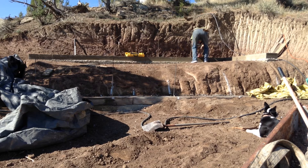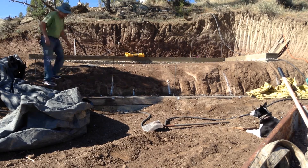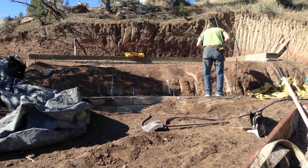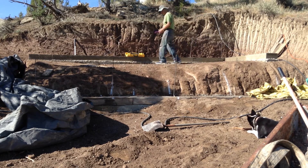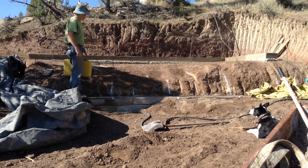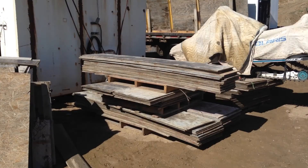The doggone stick supervisor is back, patiently waiting for me to throw a stick for him. In order for this lower foundation wall to be level with the top of the footing on the upper one, I've got to have three foot and one and a half tenths. Even calculating with the eye level, I come up to around three foot, so as inaccurate as that is, it's still pretty close.